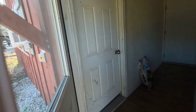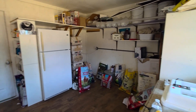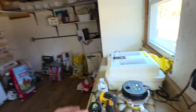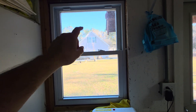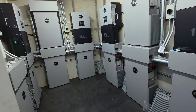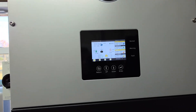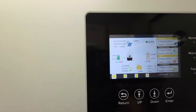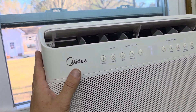That unit is now supplying cold air for what is the tack room — now just the barn room. I have a refrigerator running out here, two incubators going, and I'm powering the house. I work from home, so I'm drawing a ton of power for that. I've got the pool pumps running and my solar system. Even yesterday with clouds all day, my solar room was still cranking in power. It charged the batteries to 85% today, and by tomorrow they'll be at 100% by noon even with this unit running. I'll set this room to 70 — I'll probably cool it down a little bit more. I just didn't want to run it too aggressively.